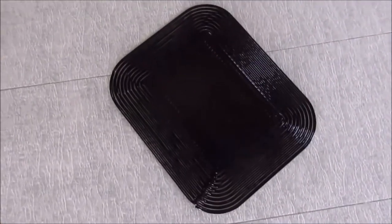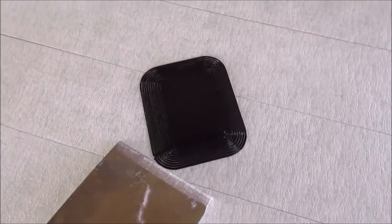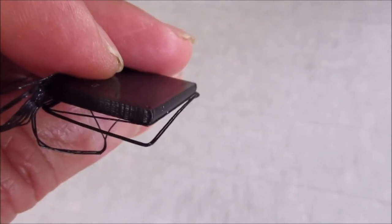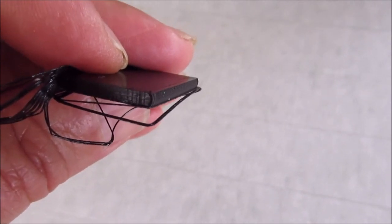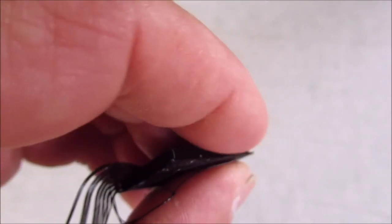So this is one vane. I gotta print 6 of these. And it's imperative that the design be just right on. Not the design, but the print. See? One of the edges is rounded off and the other one's flat. The rounded off edge is where the seal is going to be made to the stator ring housing, right? This side is rounded off.